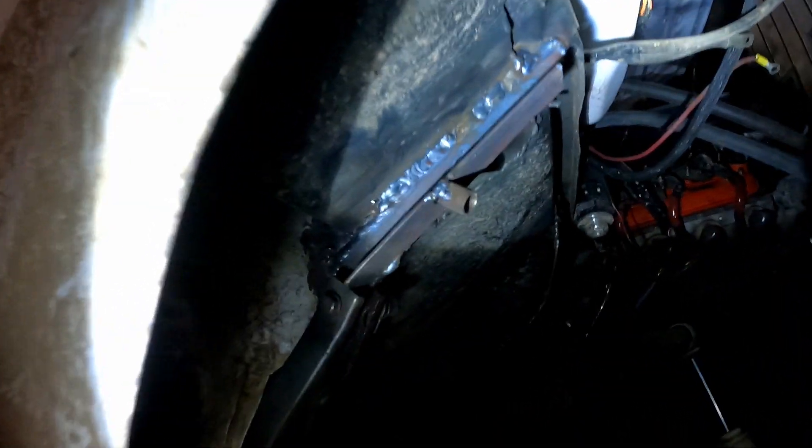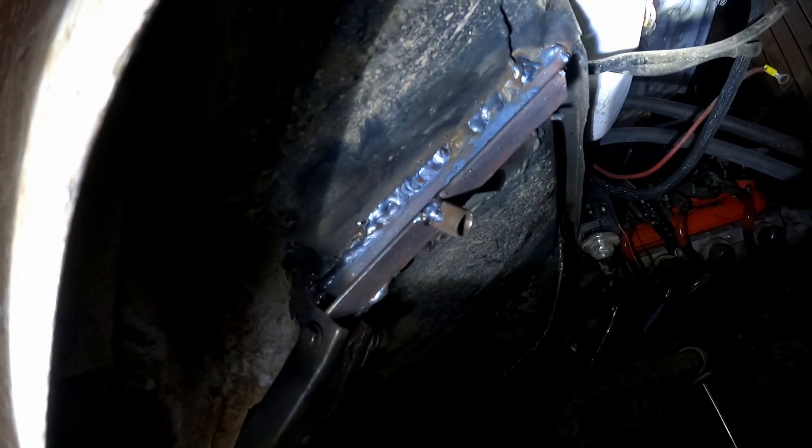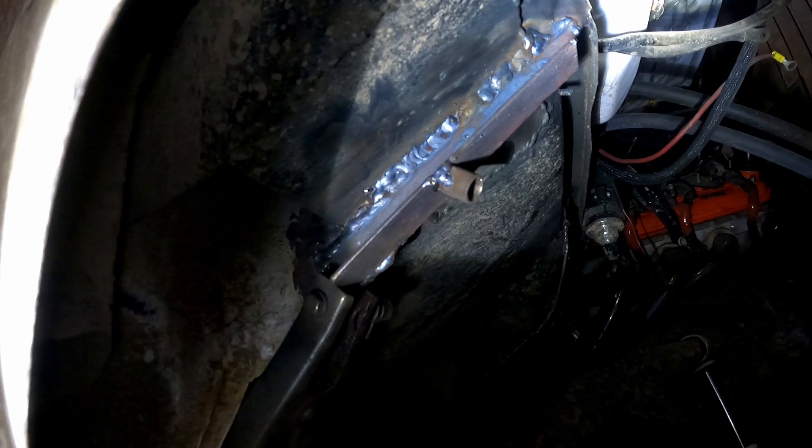We're losing daylight fast. I put the wheel well up in place and put the bolt through, and put that collar in there as a spacer because the wheel well doesn't come flush to it. That's the angle we'll need, so I'll weld a nut on the back of that and the bolt just slides through that tubing into the nut and threads in. We should be golden.